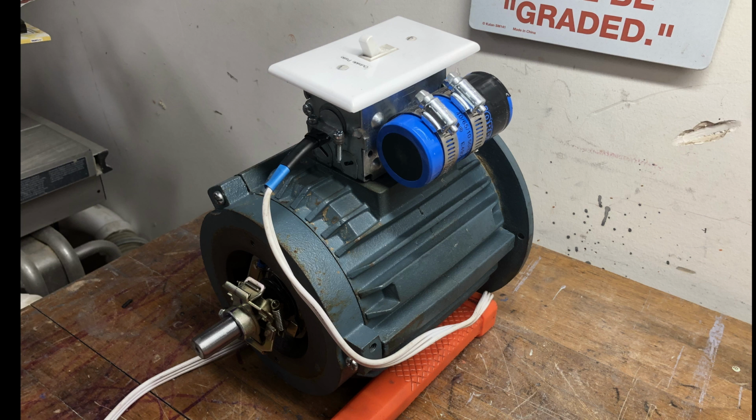I think I tore this motor apart at least 15 times till I realized that mistake. It looked shiny, so I thought it would work, but I couldn't figure out why the solder wasn't wicking. Well, that's why. I also added a switch because I was tired of plugging it in every time I wanted to test it. The motor jerks violently when you plug it in when it's on its side, and I just felt better about it this way. So once I got those problems resolved, it was working just fine.